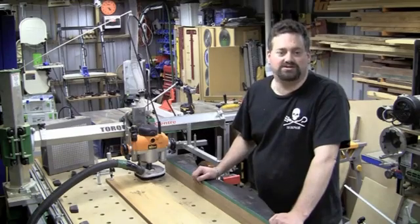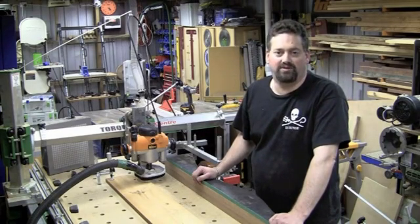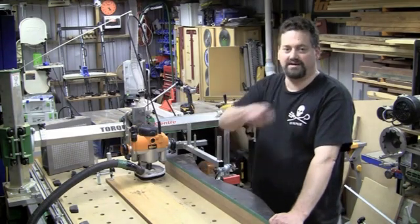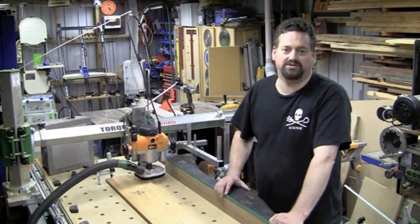For those who have seen the photos, I ended up with a result I'm very happy with — it was a top of mahogany and I put in a river of jarrah through it. That required me to cut a pattern out of the original timber and then cut the same pattern out of the jarrah to be able to put the two together.